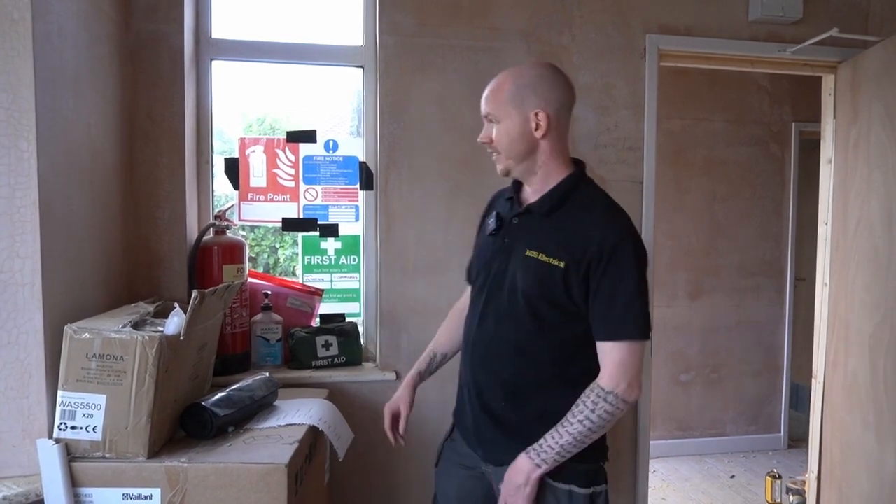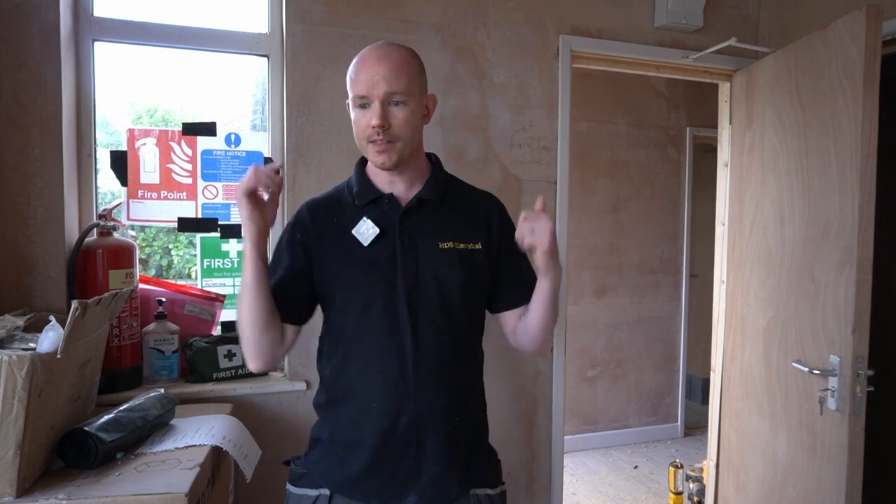There are bad patches all around. We're going to take some pictures from all around this job. It's just because they watered down the PVA too much — possibly because they used some cheap, crappy PVA. I don't know if they'll get away with it. In the other room it's physically flaking off — the top layer, the final coat, is physically peeling off in some places.